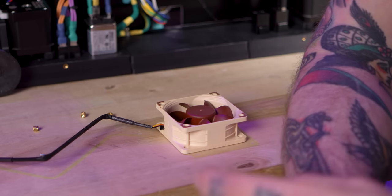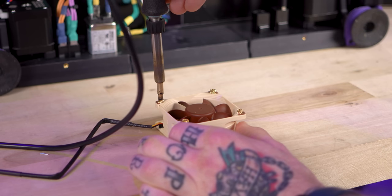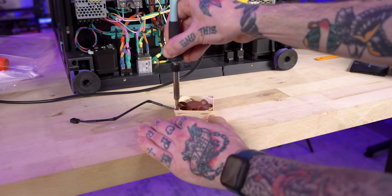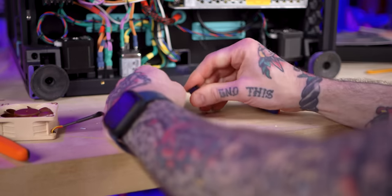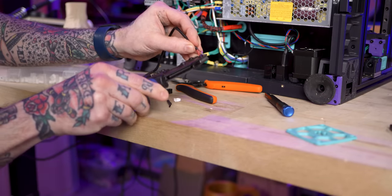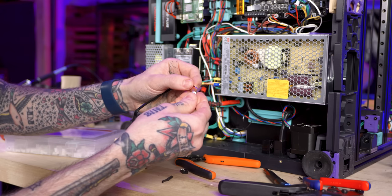For installation on the Voron, we need to put some heat press inserts into the body of the fan so we can screw it into the side skirt. These Noctua fans are probably glass-filled nylon construction — I can feel a crunchiness as I insert the heat press inserts and it definitely takes a fair amount of heat. For the wiring, I'm going to reuse the existing harness and keep as much of the sleeving as I can. With this three-wire Noctua fan I don't need the yellow TAC signal wire, so away that goes. Once the wires are stripped I crimp on the terminals, slide on heat shrink, seal it up for a clean finish, and connect the JST-XH two-pin connector.